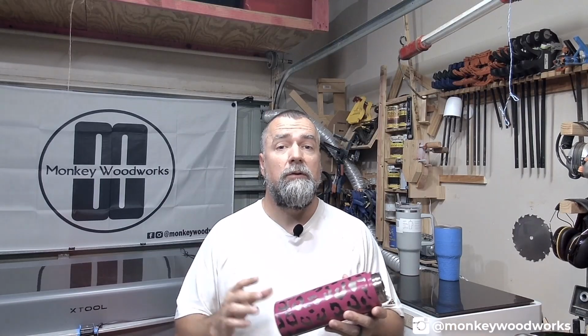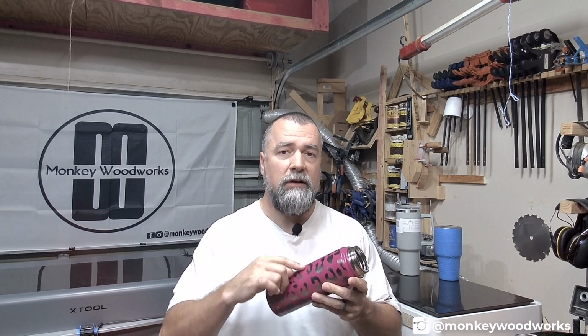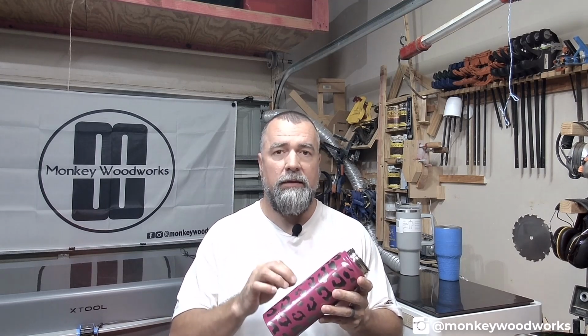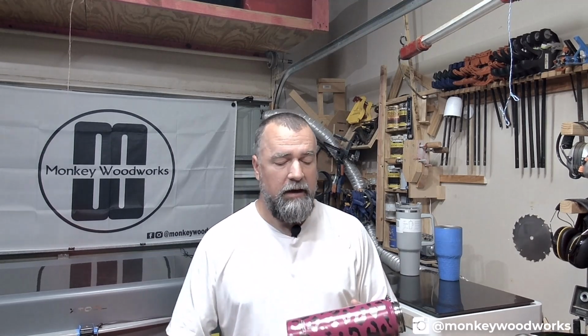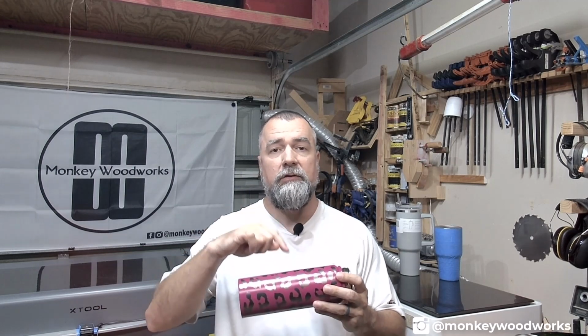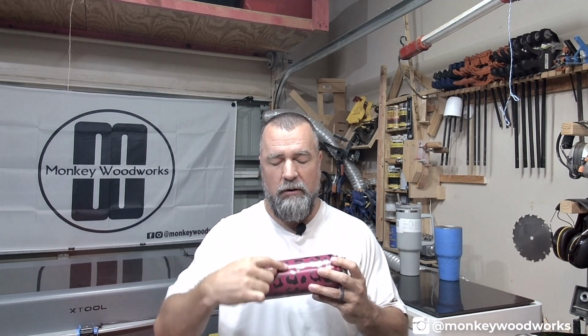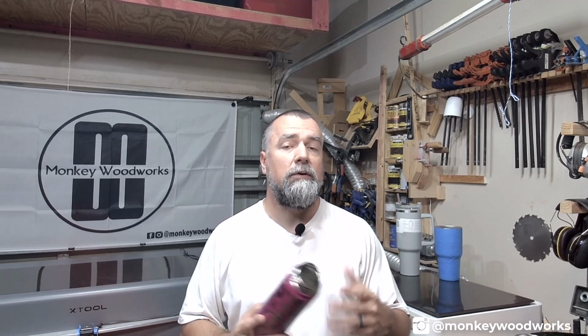So next thing I want to do is take the measurements that I have and see, does it actually match what I need to do to wrap around this and have a perfect 360-degree engraving. What I like to do is use my blue painter's tape, and I'll wrap this 2 times in a single strip, and I'll score an object on here all the way around, and I'll check to see, does that object line up or does it not? Let me share with you real quick how I draw that object here in XCS.